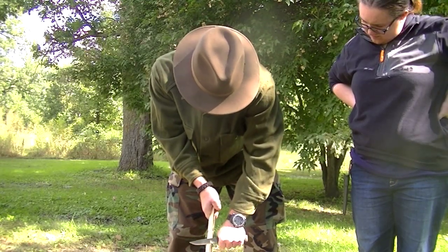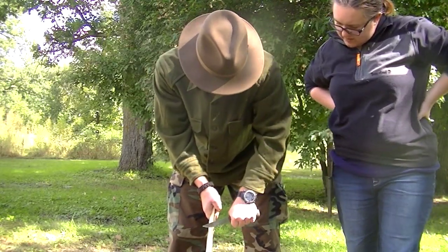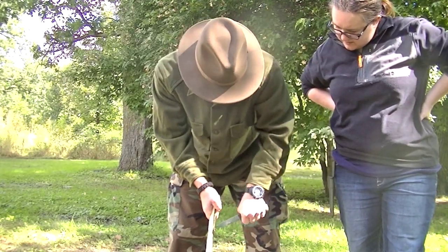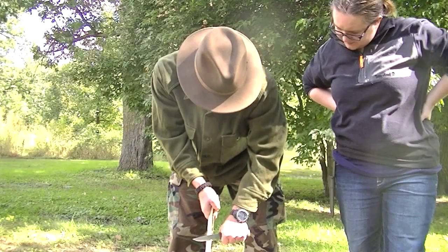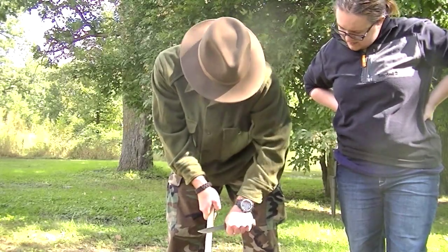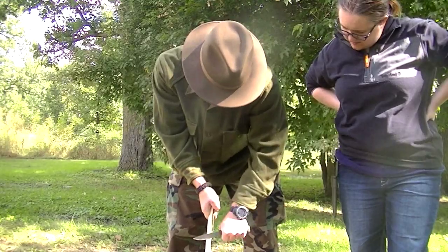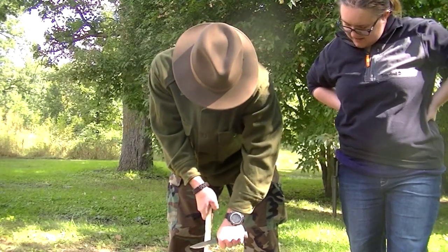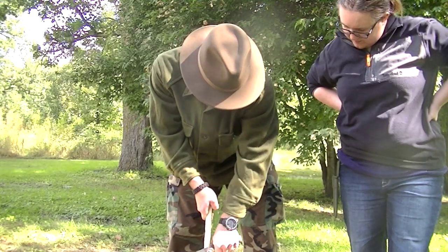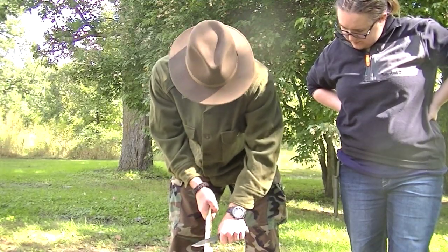It helps if your knife point is down a little bit and you push it forward rather than going straight down. It'll work if you just go straight down, but it works a little bit better if you go sideways. Does that make sense? So I'm cutting, and when you get too many curls in your way, you can cut them off.